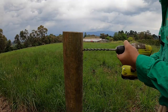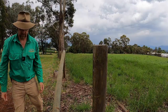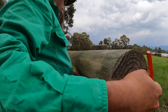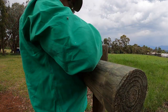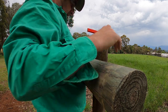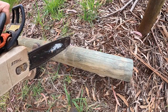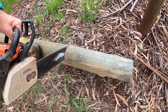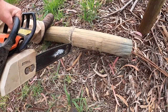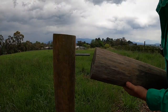problem of the tree that was really crowding the fence line, and in fact a couple of feet over. Rather than drill new post holes, buy new posts and fit a standard 3 metre top rail, I just lashed out on a 4.2 post on either side and used the existing intermediate posts that were in pretty good nick. I made a slightly longer box end assembly either side of the tree.